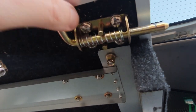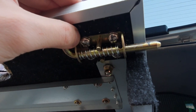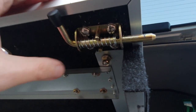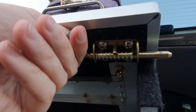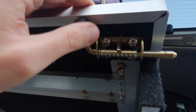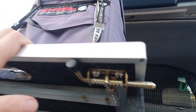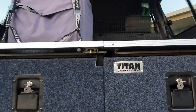As you can see, it's now secured by these M6 bolts. You do need to drill out the latch as well - it's a 6.5mm drill bit, just make it a little bit bigger so you get a little bit of adjustment. It does still spin around and catches a little bit on that cotter pin, but it's nothing to worry about - all works fine once you get it past that point. You can slide it anyway and yeah, that's it guys - pretty simple upgrade.